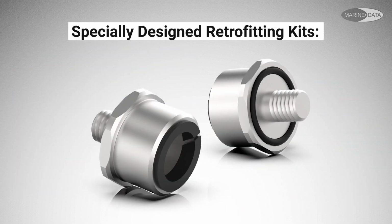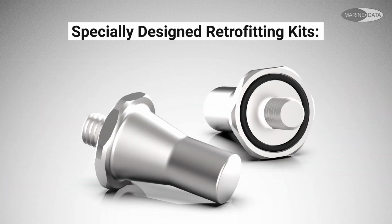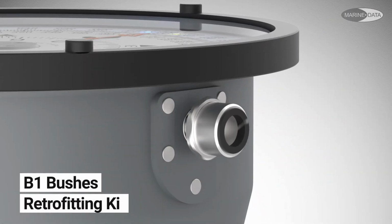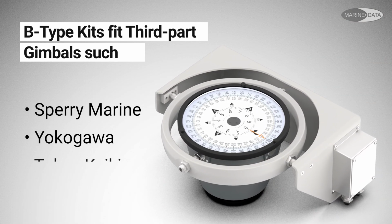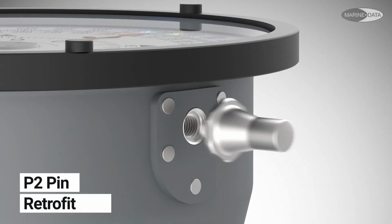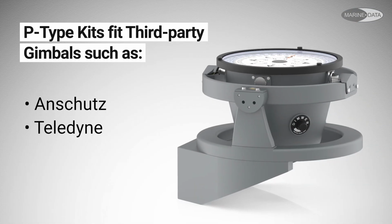The specially designed retrofitting kits come with either gimbal bushes or pins, making it easy to fit a host of third-party gimbal rings. The B-type gimbal bush kits are used when retrofitting bearing repeaters with bowl pivot bushes, for example, manufacturers like Sperry, Yokogawa, and Tokyo Keiki. Whereas the P-type pin kits are used when retrofitting bearing repeaters with bowl pivot pins, like Anschutz and Teledyne.